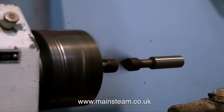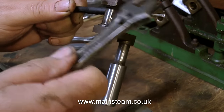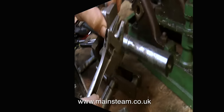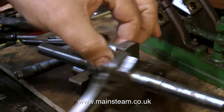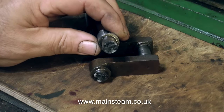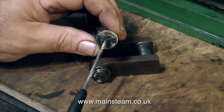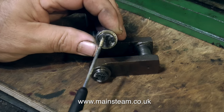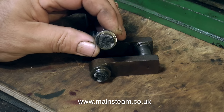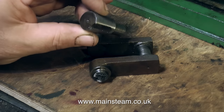Something just did not feel right with this crankshaft, so I took it out of the chuck and gave it a tap test. By tapping it with a metal bar — or in this case a spanner — it should have a nice ring to it, like this 5A crankshaft. This is a brand new 5A crankshaft and it's perfect. When I tapped this crankshaft a little bit harder, this is what happened — it broke in two at the eccentric end, not at the flywheel end. If you have a close look at this, you will see that it has been broken for quite a long while. I put very little stress on the crankshaft to achieve this result. Quite a dangerous situation.